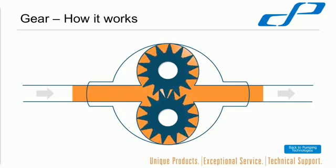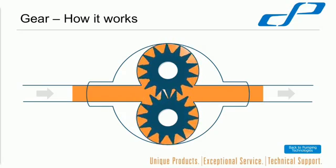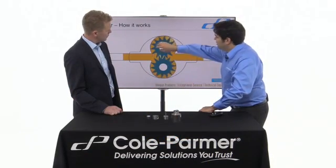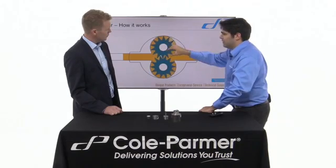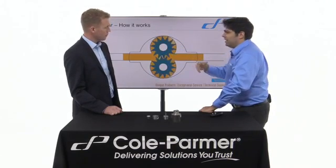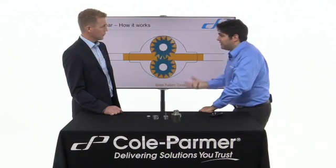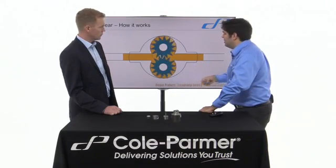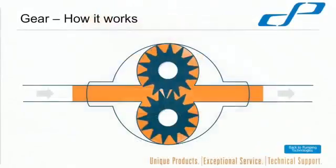Would these packets of liquid not generate a pulsed flow? In theory, yes — they do generate a pulsed flow because you are ultimately taking packets of liquid and moving them along. However, as we mentioned before, the packets are very tiny and there are lots of them, going very fast. So the end result is virtually a smooth flow.